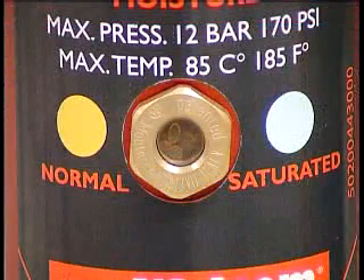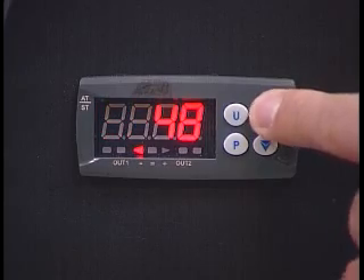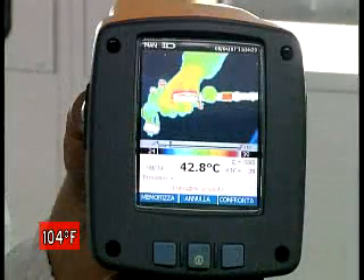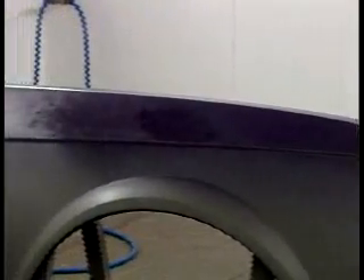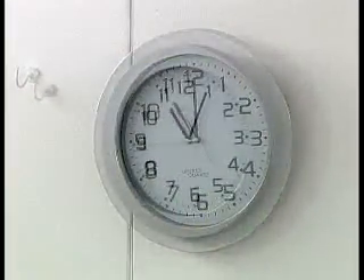What are the results of using TD3? Once the required temperature is set, working conditions are totally different. Air temperature in the gun stock and in expansion is over 40 degrees, totally pure and dehumidified. Combined with the 20 degree paint temperature, this permits excellent application conditions. Hot air also provides significantly lower drying time, up to 30% lower than application with non-heated air.